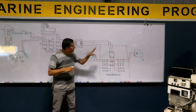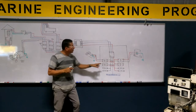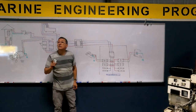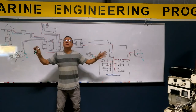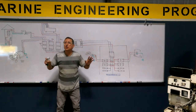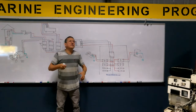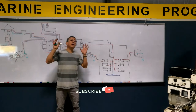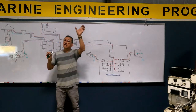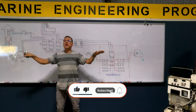I have another air conditioned equipment in that boat. Where is it recommended to install that air conditioned equipment? Here in the other breaker or here in this breaker? You have another air condition? Doesn't matter. No. You need balance. Both charge. What is the element with more consumption of amps in a boat, in your home? The AC unit, the air conditioned unit. If I have two air conditioned units in my home, I install one on one side and the other one on the other side to keep the amps balanced.